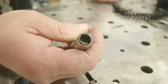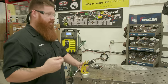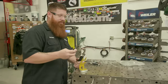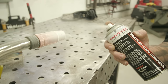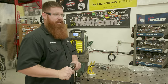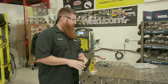Make sure your nozzle is clean. If you have spatter built up in there you'll have poor gas flow — poor gas flow means the gas won't properly shield the weld pool, and that spatter can fall off into your welding area. Get yourself a good anti-spatter spray. For short circuit MIG, even with settings dialed in you're still going to have some spatter, so I'd recommend an anti-spatter spray like the Contesco ceramic formula — it lasts a long time. Keep everything clean.